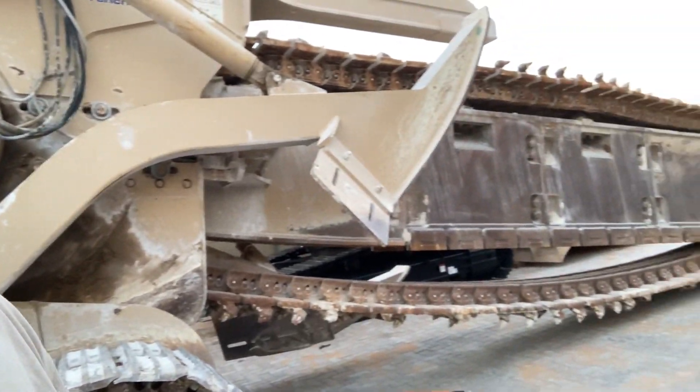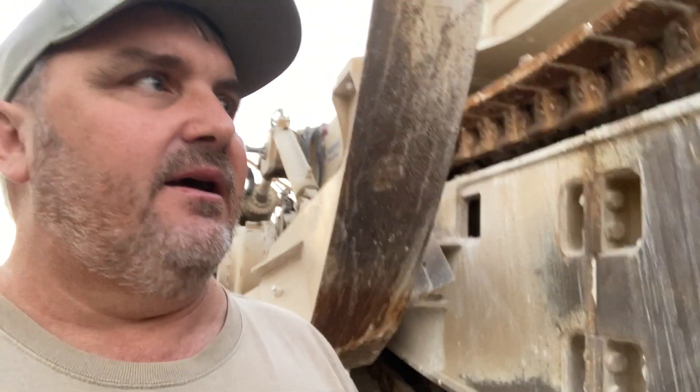Apart from the clean inside and out, of course we've got to go through and hard face the whole digging chain assembly as well. They kind of love to run them without any hard facing over here. So we'll retighten every bolt, every plate bolt on this, replace any pockets that need replacing, teeth that need replacing, and then get going on all of the hard facing and building up any of the plates on the corners to make them tip top.